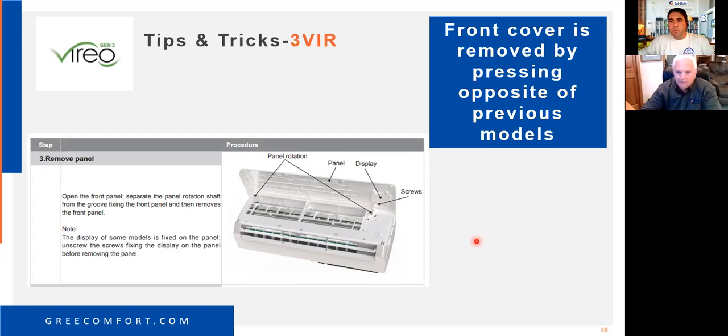So can you give our viewers today how do you recommend cleaning the blower wheel in these? How's the best way to access, with the fan running all the time and cooling, these blowers get dirty. From your experience, and maybe on this one, how are they going to clean the blower wheel on this? In my experience cleaning the blower wheel, you'll need to take the outer shell off, and then you'll need to loosen the evaporator coil, and it lifts up just enough to where you can get that wheel out of there and you can take it out and clean it.